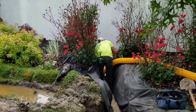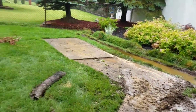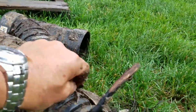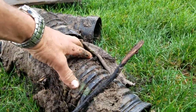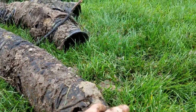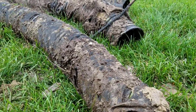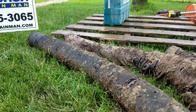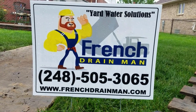We had to tunnel underneath the fence to get to the storm drain catch basin. Being a yard drainage contractor isn't sexy or glamorous — it's muddy and sometimes it's not pretty. Here are two different pipes from two different attempts at this. Here's that polyester soil separator on a three-slot staggered pipe. This one was white originally, this one is black — we found both failed systems. This one has some dirt in it too, but you couldn't get water in the pipe anyway because they didn't wrap the trench and separate the soil from the drainage stone. For a French drain system built right the first time, give us a call.